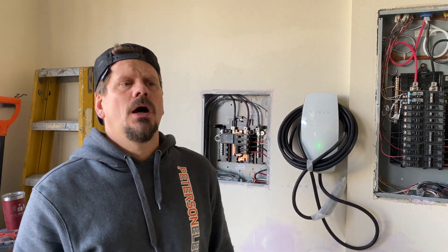A lot of people call me and say they need a 240-volt install or a dryer outlet. For an electric vehicle, you typically have to use copper wire, unless you're going aluminum to a disconnect and then copper to the box. Sometimes people do that because it's a little cheaper over a far distance. In general, it's going to be a 50 amp service, 240 volt. I would typically pull three wire — it's a more common conductor — with ground. I wouldn't do two wire with ground. Even though Tesla has gone to just a three-wire connection, other electric cars are four wire because it's with that ground.